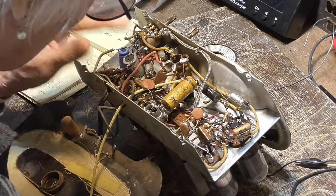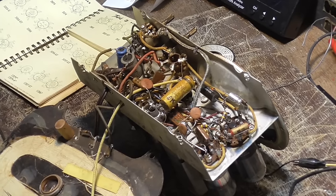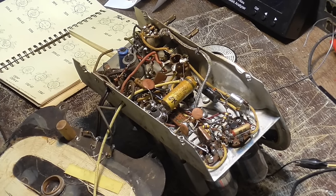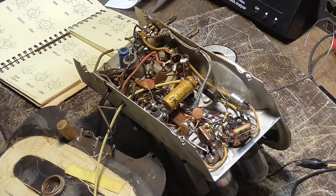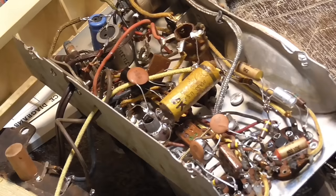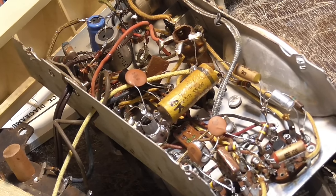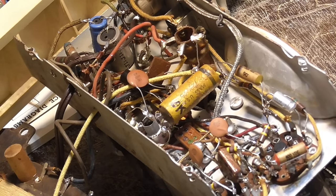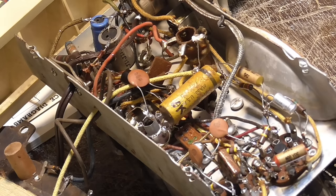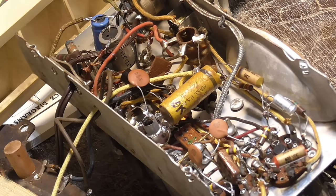And it's screwed up. All right, let me get a schematic. All right. We're looking for RE201. RE201, Arvid. All right. Looking at the schematic, the capacitor that I'm missing is from the AGC to ground. The AGC has no filtering. That will certainly cause the problem.